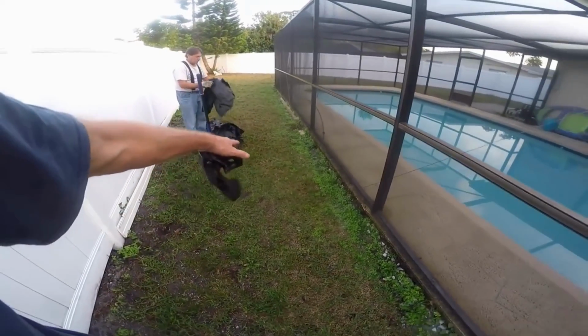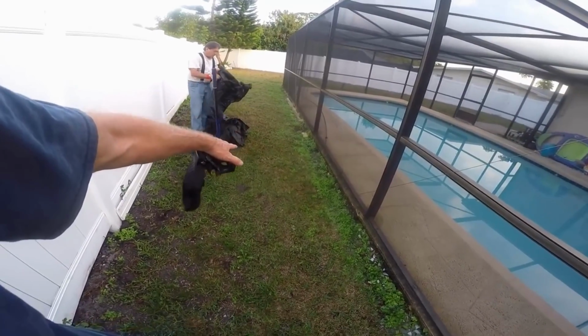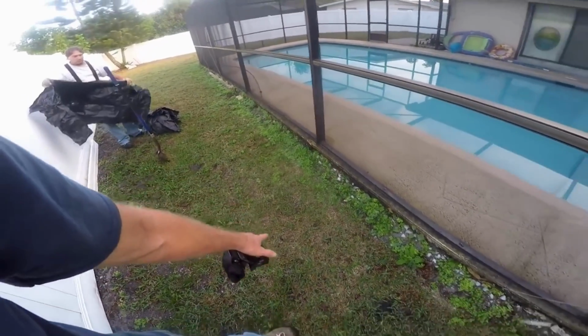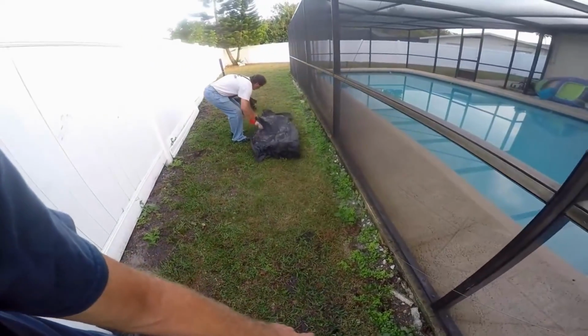And what we're going to do is put a French drain with a couple of catch basins. Remember, a French drain is perforated pipe surrounded by gravel. We're going to encase that in fabric. That will run between here and back where Dan's laying out the tarps.